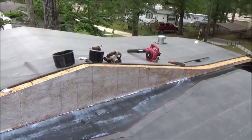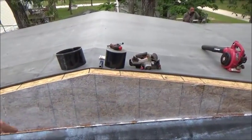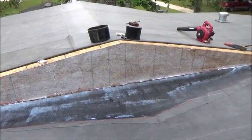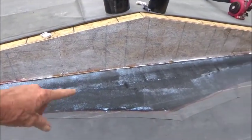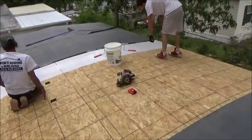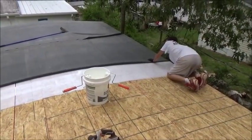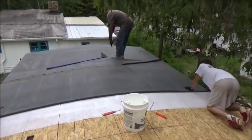On this section here, this is a little different. We put bonding adhesive here and there because we're going to stick it up that wall and I don't want it to slide down while it cures. This is contact cement, so you want to be careful putting it up the wall — where it touches it sticks. Do that section very carefully. You wait until the adhesive turns back clear; in this situation, you want to leave it milky white and then pull your rubber into it, because if it's dry your rubber will not stick.